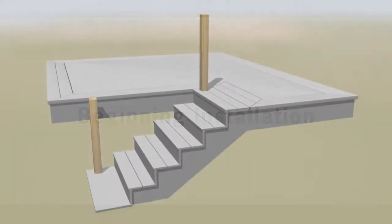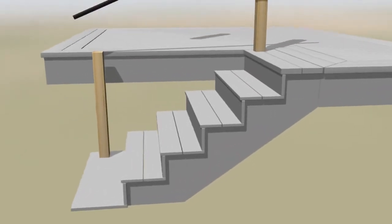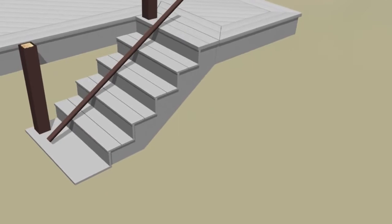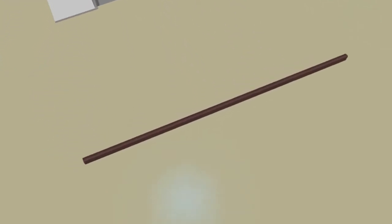A typical stair rail height is between 34 and 38 inches, measured from the leading edge of the stair tread vertically to the top of the rail. Be sure to consult local building codes prior to installation. Rest your bottom universal rail on stairs and transfer the length and angle of the stairs onto the rail. This angle will be used throughout the entire installation.